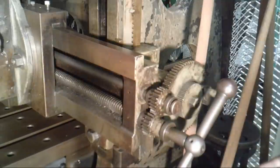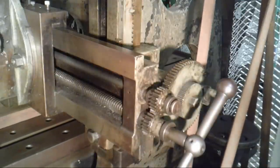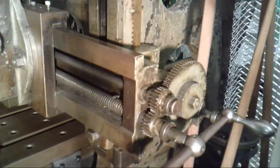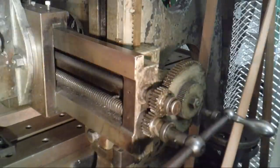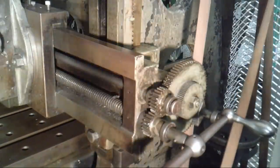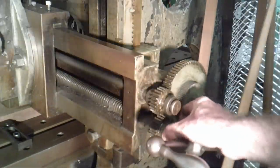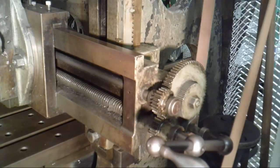At the start of the cutting stroke, before the tool enters the work, the handle turns and moves the tool head over. At the end of the stroke, the ratchet goes, and we return back — the tool head moves over. At the moment this is moving about eight or ten notches. I know from experience I want a very fine feed. The finest feed I measure on here is about twelve and a half thousandths. I'm used to ten thousandths on my metal shaper, so that's right in the right ballpark. I'm going to adjust down so that I'm getting one click on each return. I can also engage the gear and get an up and down motion out of the tool head, but right now I have the tool head locked.